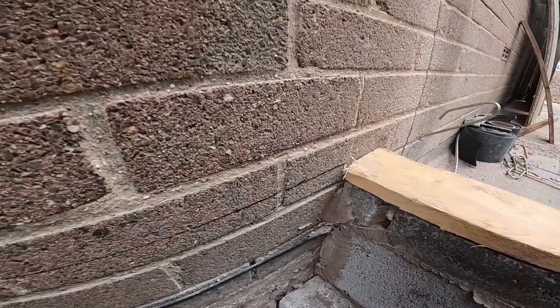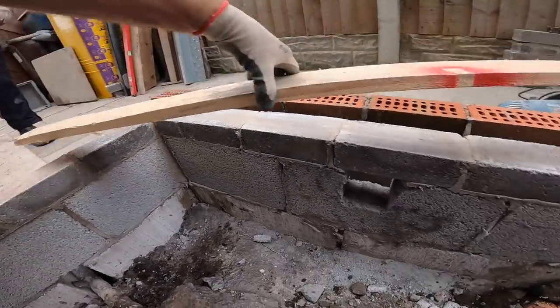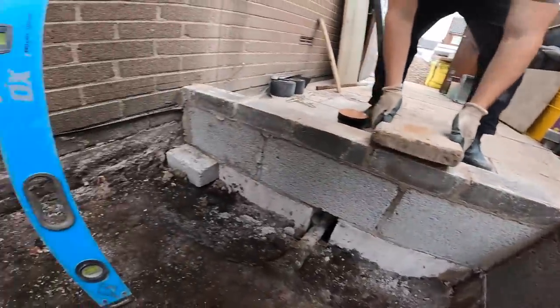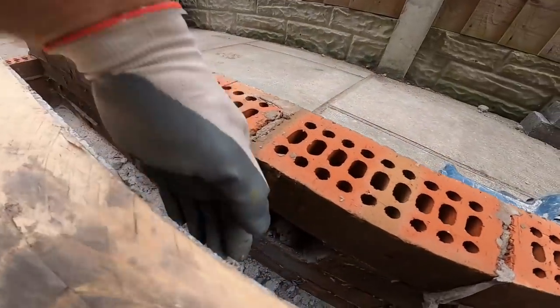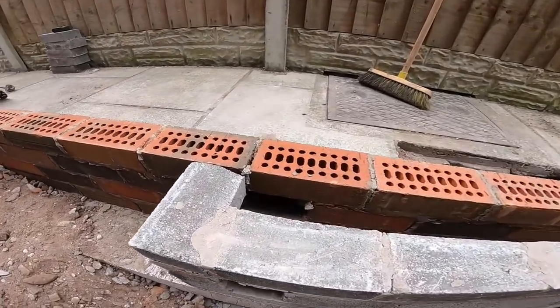4x1 with a packer. So we're going to fix this and tamp off it. With that going on, that brings our pipe plenty low enough into the insulation and out of the concrete. So we're going to smash through here now with the breaker, put our pipe in, and then the pipe vents into the cavity, and then we have two vents, one there and one there.